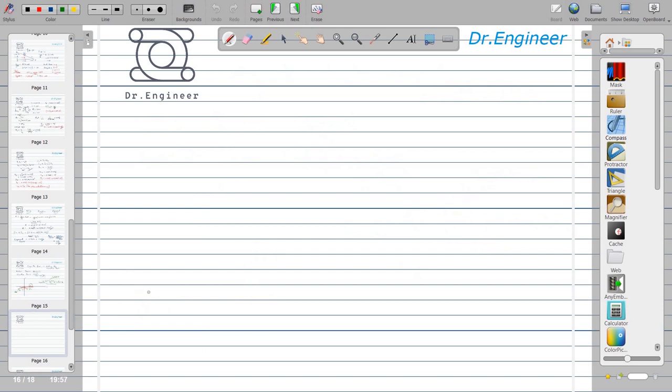So the next part is, they are asking the characteristics. The new question asks for the characteristic of a circuit at resonance. At resonance, reactive power is zero, right? That is, the reactive power is zero. So the power factor would be one.